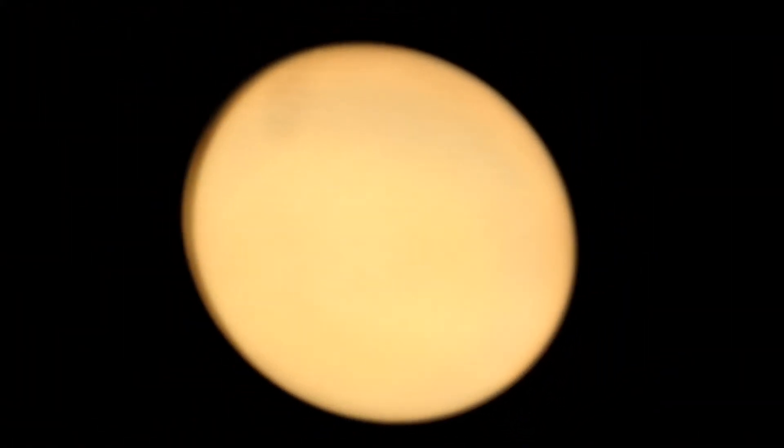That's basically a circular television screen right there. I know it doesn't have a shadow mask or anything along the lines of a Sony Trinitron, for God's sake. But yeah — it's electrons striking phosphors, making them illuminate using the same circuitry you'd find in a CRT television. There is an electron gun in there with filament heaters, a second anode, and a flyback transformer. And when you touch it — hear that? Static electricity, just like on a TV screen.